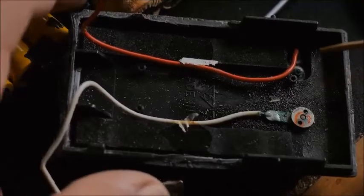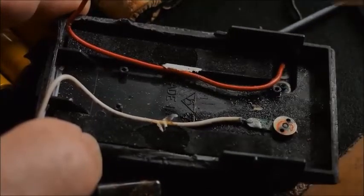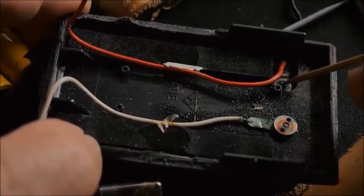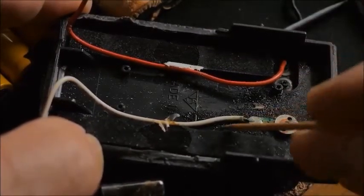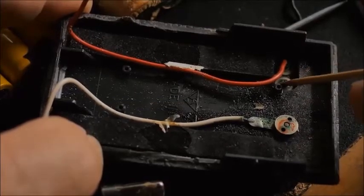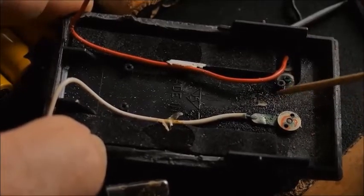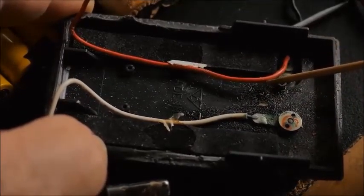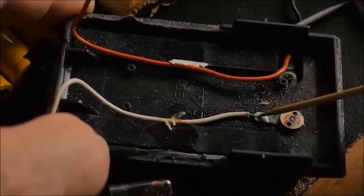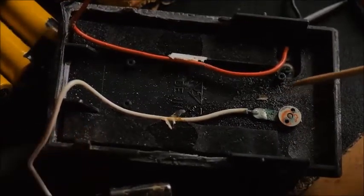Looking inside this battery case, it's pretty dirty. One black lead came off one side and the positive lead may be on the other, so I'm going to re-solder both of these and also re-solder this white wire here and clean these contacts up. It looks like it was spilling a little bit of acid in here. I might also make these a slightly heavier wire since they seem fairly thin for charging — they're probably stranded.